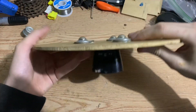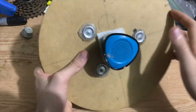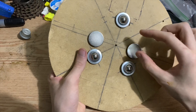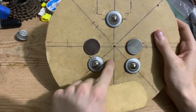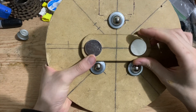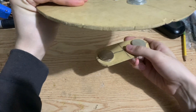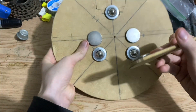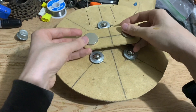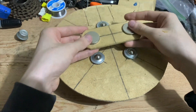Here I've got the head. I drilled three big holes for the rollers to fit into and glued around them. I found where the center was and placed a mounting piece right there in the center. This piece is going to be on the inside holding things on, while the outer piece is on the outside of the ball so the head stays on. It only goes one way — it attracts this way but repels this way — so the head will be straight when I put it on.